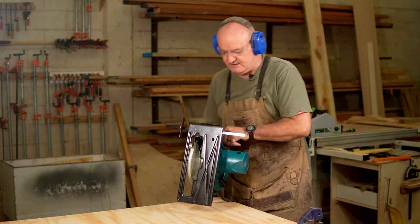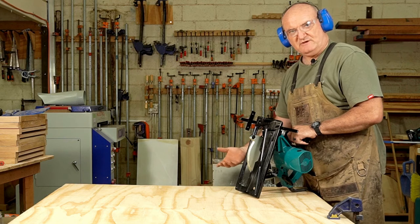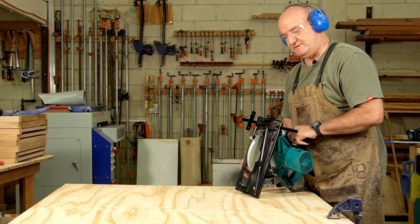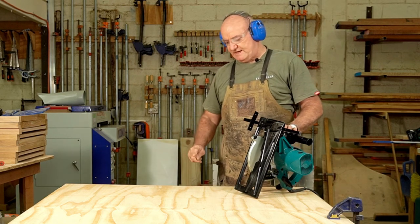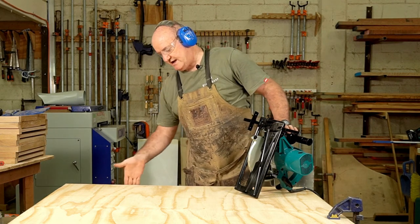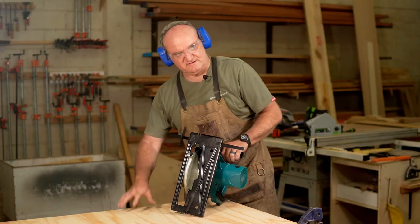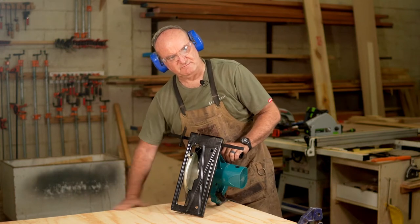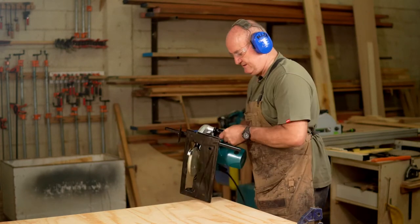We set our blade so that the blade goes just beneath the surface of the wood. You can make it go deeper if you like, but you get a much better cut if you just go slightly beneath the surface of the wood. One of the things to think about is the direction in which the blade is actually spinning. So in this case, the blade is going to be spinning like this. And what it's going to do, it's going to go in here and out at the bottom, which means if there's any chance of tear out, it's going to be at the bottom, which means that this is the show face. If you're going to use this side, that people see, then this is the side that you want to face up. Okay, so let's just go ahead and do one cut so you guys get a sense of what this is all about.